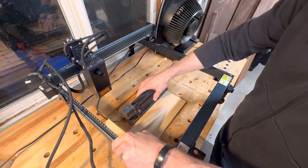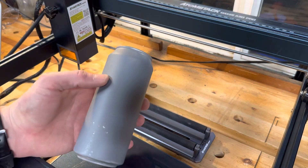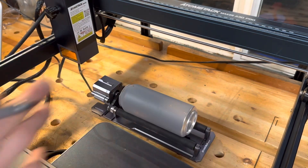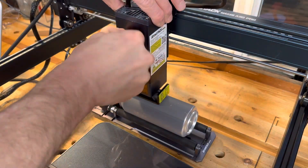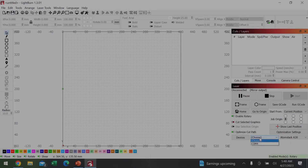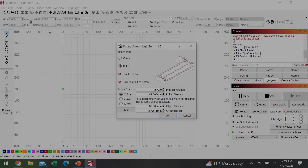I made a little jig to make sure aligning the roller was quick, easy, and repeatable — essentially just a big square that lets me reference off the Y axis. I'm going to mark my test can with a small black dot to help set my origin. I want that dot to be exactly 90 degrees facing straight up from the surface of my work table. I'll also take a moment to set my laser height. Now I'll open up Lightburn, make sure my laser is connected, then go to laser tools and select rotary setup. Here I'll select the rotary type, which in this case is the roller.